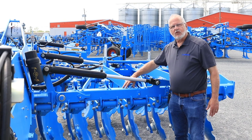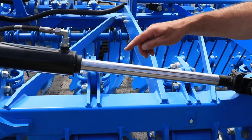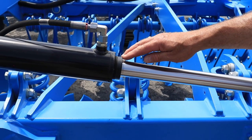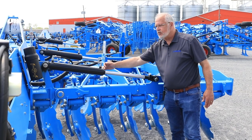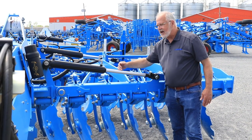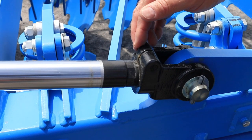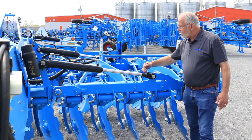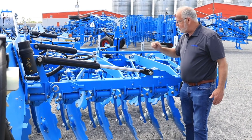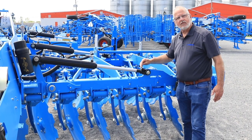If the mainframe is not level, the adjustment is made at the cylinder. By cracking the cylinder and reducing its pressure, you could then increase or decrease the number of threads, which then increases or decreases the length of your rod. If the locking mechanism needs some adjustment, you still need to crack the cylinder to relieve the pressure, but then you make the adjustment at the clevis.